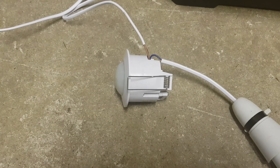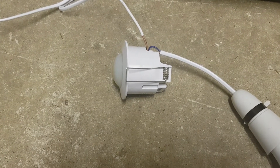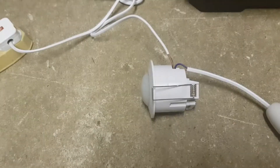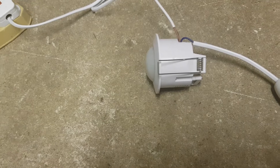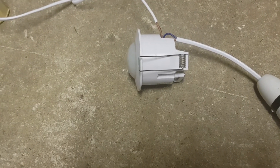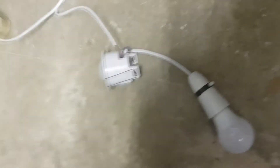This Sebson internal PIR is ideal if you want to replace a light switch in a room — say a toilet — where you don't need the switch anymore and just want the light to come on for a set period. For me personally, it's going to go in a downstairs toilet. I'll set it to stay on for three minutes, and it has multiple time options you can adjust on the sensor itself.